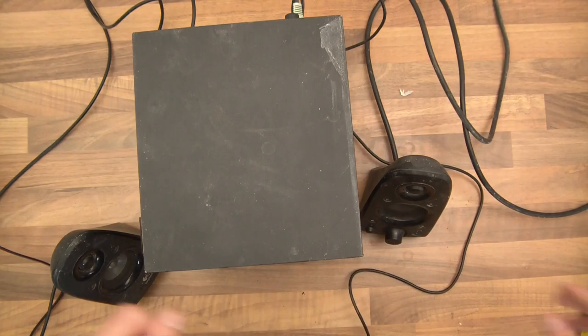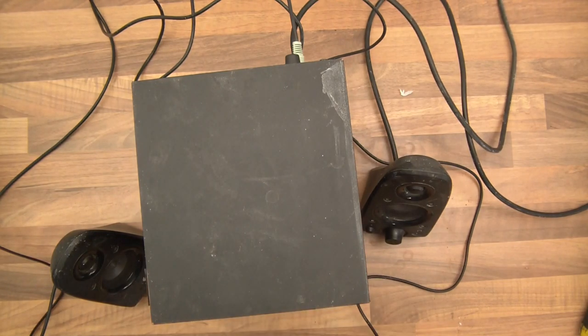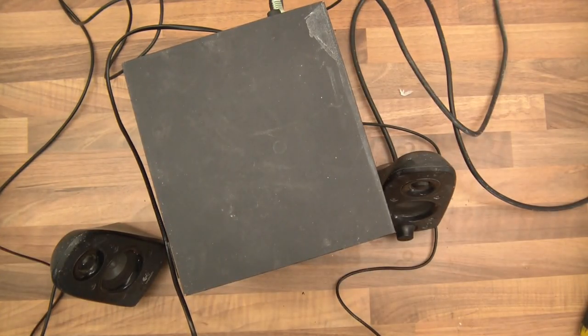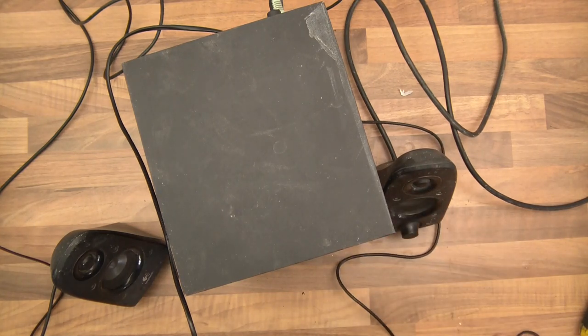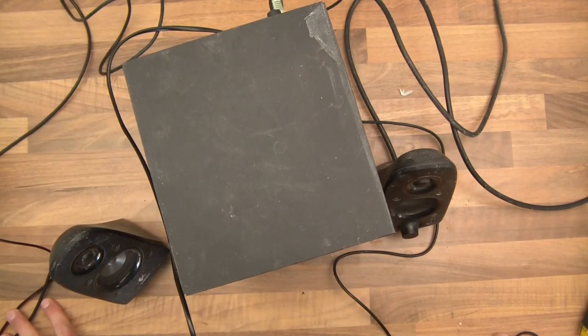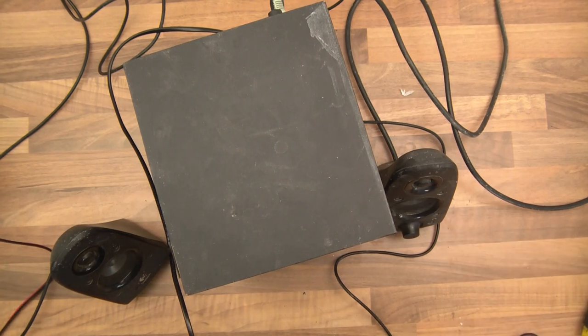And there you go — it actually works. I'm going to have this in the garden. To charge it up in that very poor way, you just plug this in. I don't encourage you to do this because, like I said, there's no BMS. In an ideal world the 16.5 volts would go directly to the cells and charge them up — and it will do that — but with no BMS you can't tell if some cells are on their way out, being overcharged or undercharged. That's why I don't recommend it, but for testing and messing about, for me it's great. So yeah, don't do this — but it does work. Thanks for watching, bye.